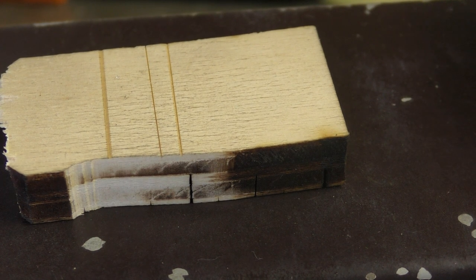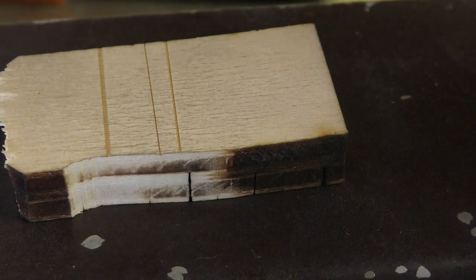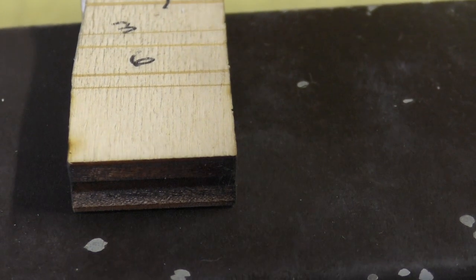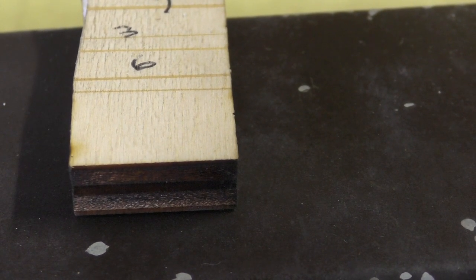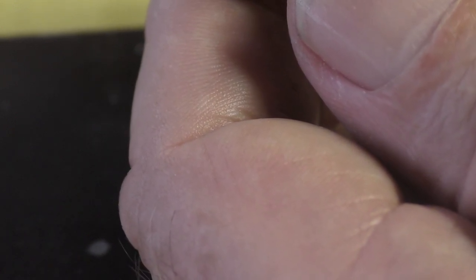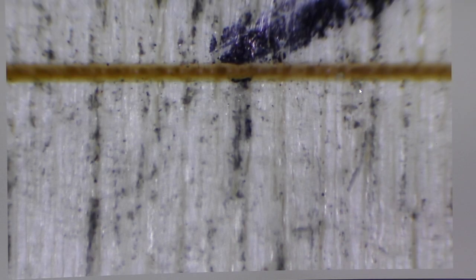Now for comparison, I want to burn a line across the center of the machine where I thought the most powerful beam was - at a thousand millimeters a second. That's my thousand millimeter per second line. I very much doubt I should see any depth in it at all. I'll grind the edge away so it's nice and white. Staggering as it might be, even at 1000mm/sec there's probably a two-millimeter deep V in there. This is still a cutting lens. Six millimeters out of focus at 98% power - my line has gone wide but it's not gone dark; I'm still evaporating a small groove rather than scorching.